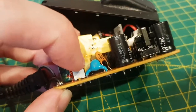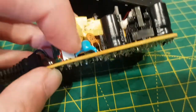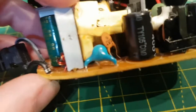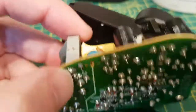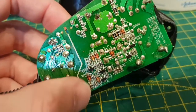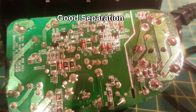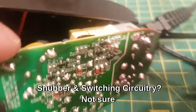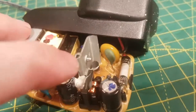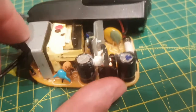It has to be a class Y2 rated capacitor — it has to withstand something like 4kV or 8kV. They normally look like that if they're the proper rated type. You need that separation between the mains side and the low voltage side. On the back of the board there are some surface-mount diodes — I think they're snubber networks for protecting the transistors. I think this is the auxiliary transistor and this is the main switching transistor, but that's about as far as my knowledge goes.